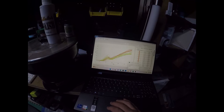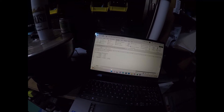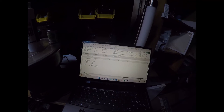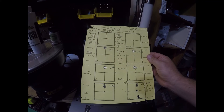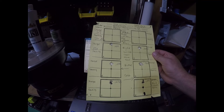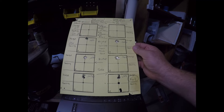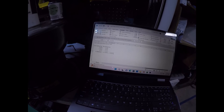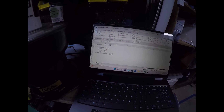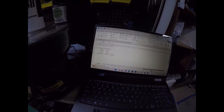But let's look at the groups, because I went out and shot them. With the corncob media, my group sizes were much larger than with the brushed procedure — almost double in size, in fact. With the brushed necks, I had two groups in the ones and one group in the low twos. For the corncob, everything was above two. The average for the corncob was 0.2989 inches, and the average for the brushed group was 0.1717 inches — a difference of about 0.1273 inches.